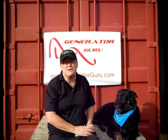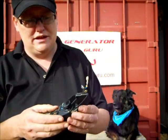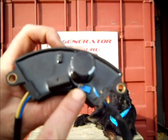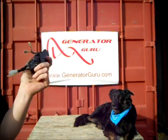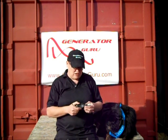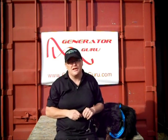When you have put on the AVR, sometimes what happens is that the power isn't coming out to full strength. That's very easy — don't worry. The AVR is made so it can be somewhat adjusted. You'll see on this AVR there's a little screw — it's usually on a blue background. You can adjust the voltage output from that usually by about 5 or 10 volts. If you find it's more than that, then either your engine might be going too fast or there might be something wrong with your alternator. If you're not sure, check out my how-to-test-an-alternator-and-AVR video.